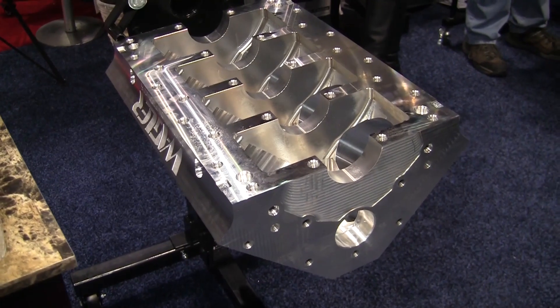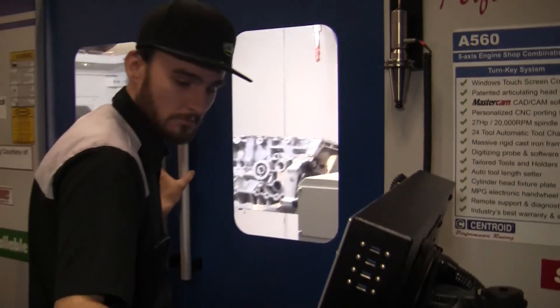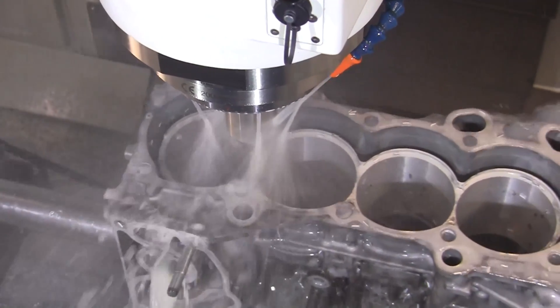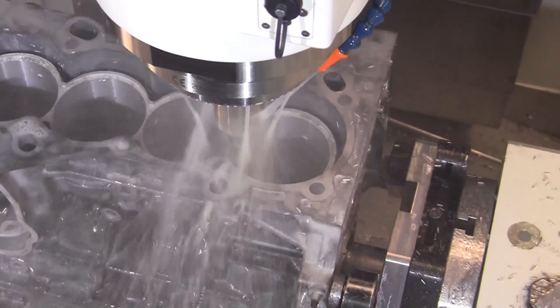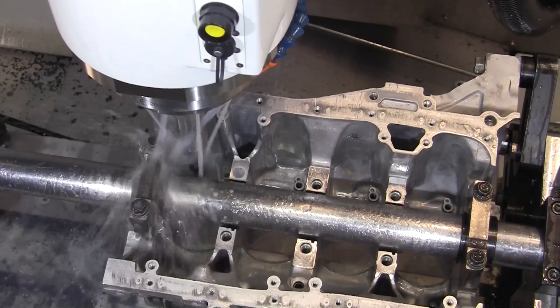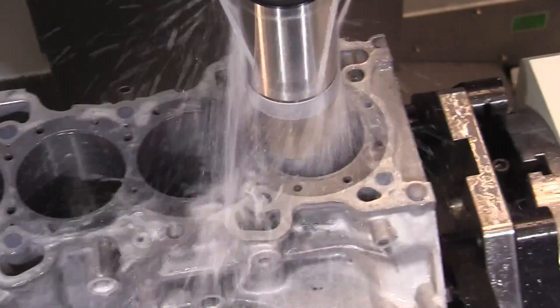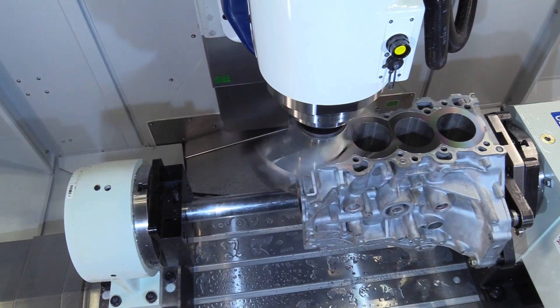It ends up weighing 80 pounds. On the other side of the booth, Nick from Victory Precision Machine was using an A560 to punch out a bunch of Honda Block stock sleeving in preparation for a new sleeve installation. In addition to the CNC blueprinting and sleeving work, the Honda Block is also relieved for connecting rod clearance. After the sleeves are installed, they are precision bored and then decked to the proper height.